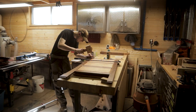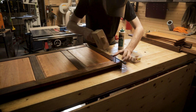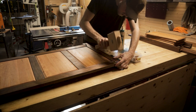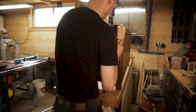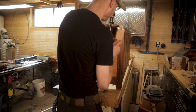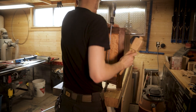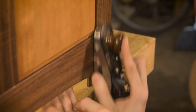For the glue-up I made sure to use Titebond 3 because I wanted as much open time as I could possibly get — there are a lot of pieces to get together and I didn't want to screw it up. I started by doing the front and back frames because they were going to be the most complex, then moved on to the side frames after letting the front and back dry for a little while. With everything together it was all very solid, and there weren't really many clamps needed other than in a few areas where I wanted to pull joints a little tighter.